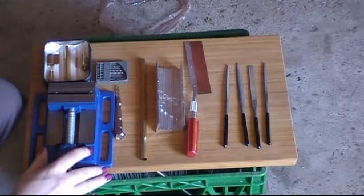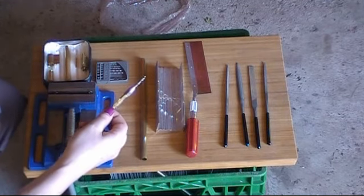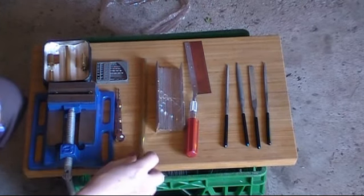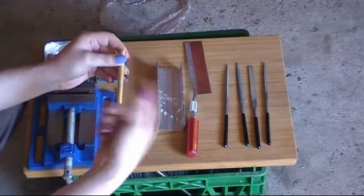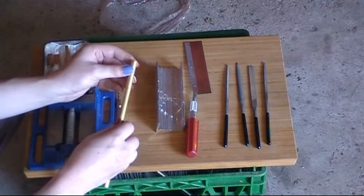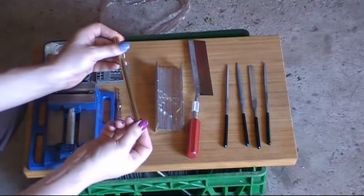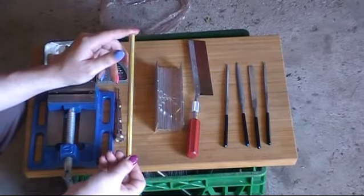So you'll need that. You'll need a clamp. You'll need drill bits. This is my pin vise. I use this for stuff that's too delicate to use a power drill on, which is great for that. You're going to need some way of cutting the tubing. I was doing this with just one of those rotary wheel tubing cutter things that look like a C-clamp, but it bevels the edge, and I'm going to try cutting it with this saw in this little miter box in the hopes of getting a nice flat non-beveled edge, because that'll work better when everything's assembled, although it worked pretty good not doing it that way.